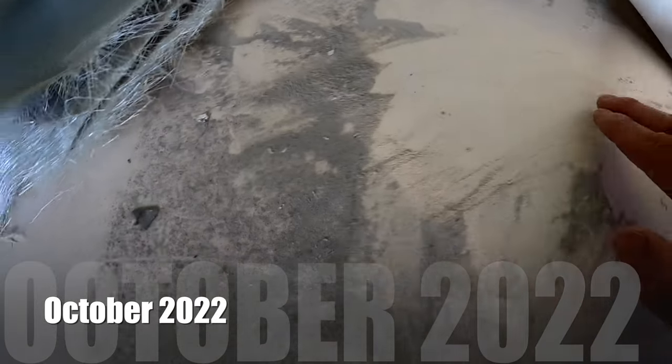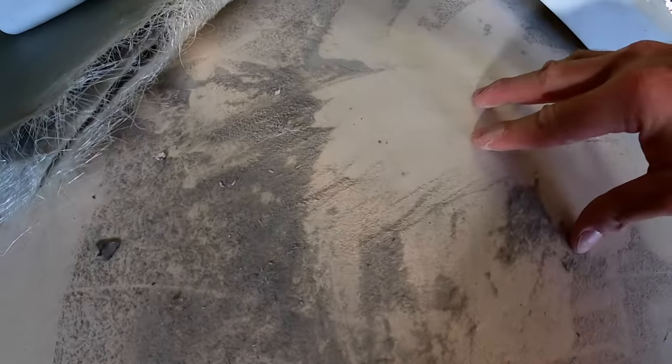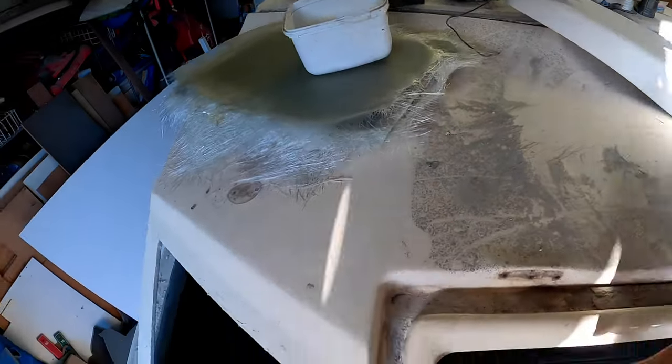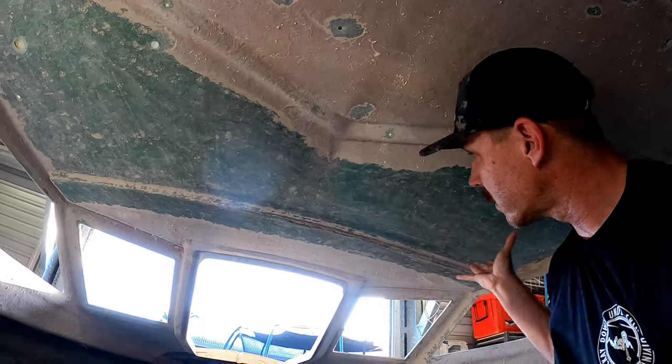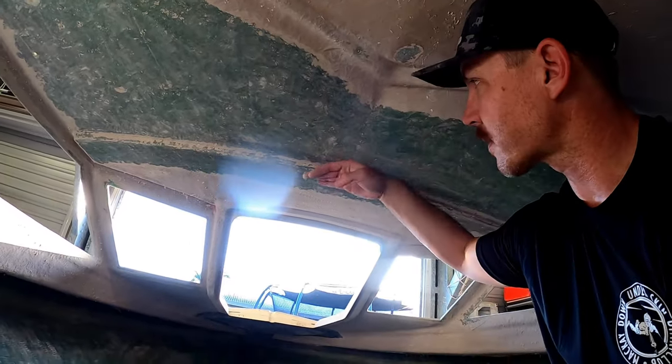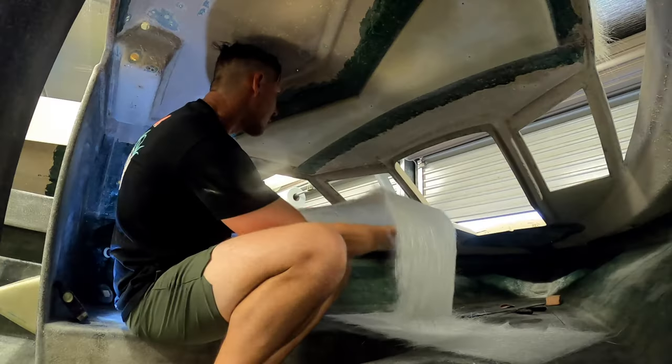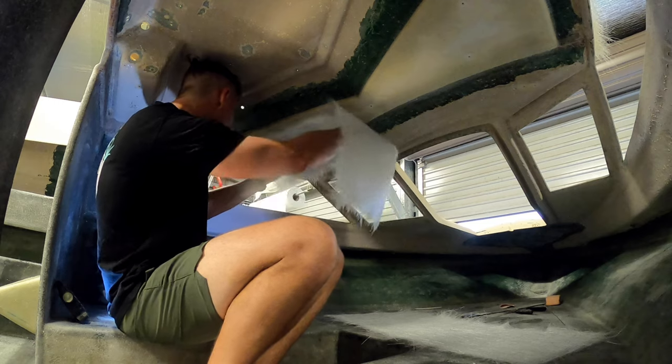There was a little bit of a crack just right through the center — this is the top of the cabin there, just flexes just a bit. So I'm going to put a whole other piece across here, then glass a lot and glass it all in over top. Make it all nice and neat and really beef it up just there. Hopefully after that it shouldn't flex.